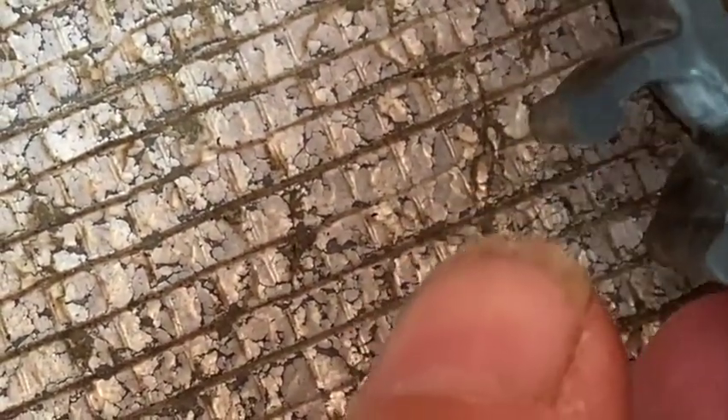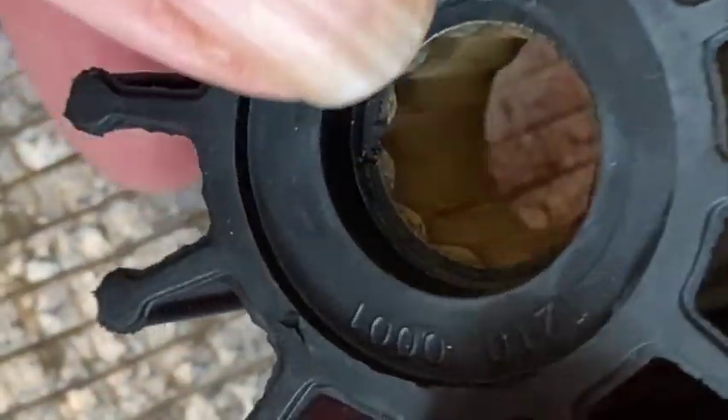It's time to replace this impeller as you can see. Look there — you can see the bend quite clearly on that one and this one too. And then for comparison, here's the new one, obviously in perfect condition, ready to go in. So that perhaps shows you how easy it is to think that the impeller is in good condition when in fact it needs replacing. Thanks for watching and until next time, I wish you fair winds and a reliable diesel.